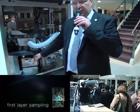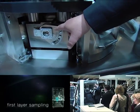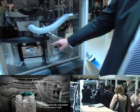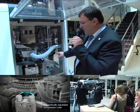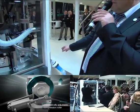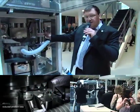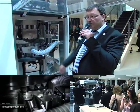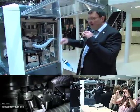Now let's take a look at the lower compression station. This machine is for two-layer compressions, so this is the sampling for the first layer. We call it the fast sampling because it can produce 30 samples within four seconds. These samples are then transported via a stainless steel tube to the weighing process. Behind it, you can see the second filling unit, which together with the height adjustment of the first unit is completely identical. All six compression stations are also identical.